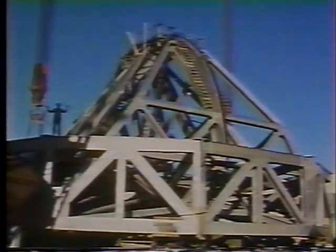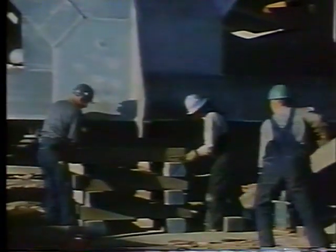Special techniques of field welding were developed for heavy aluminum sections, and a specialized group of welders was trained and qualified on the job. The aluminum is 5456, the wire filler being deposited in a helium-argon mixture. All welds were dye-checked. Strength welds were radiographed. Now the 180-ton weldment must be raised to add to its diameter and depth, and it must be moved out from under the derricks whose heft was needed on other heavy assemblies.